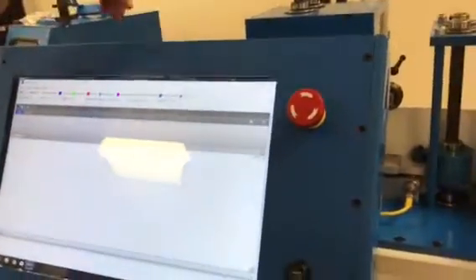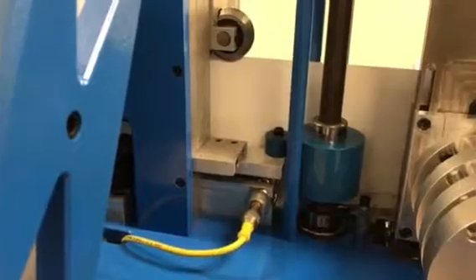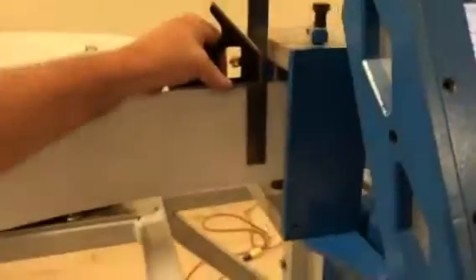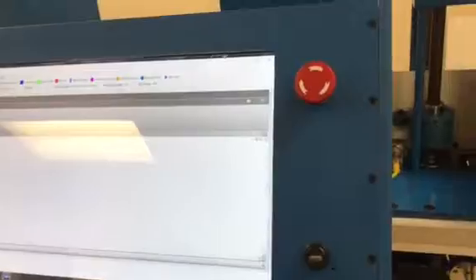Now there's one more thing to calibrate. That calibrated the encoder — a wheel that rides on the material independently from the motor. Now we want to calibrate the motor. We're going to do it exactly the same way. I'll do a home, confirm it homed correctly, use my square to make sure it's right. Then I'm going to go to Tools > Uncalibrated Feed — this only moves the motor and doesn't ask for help from the encoder.